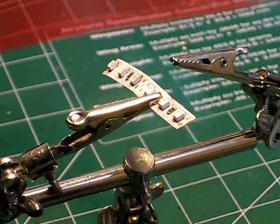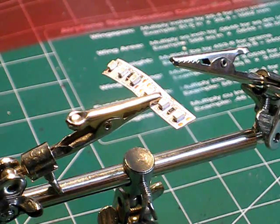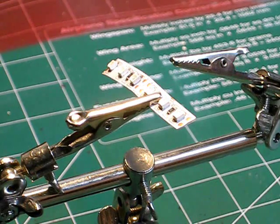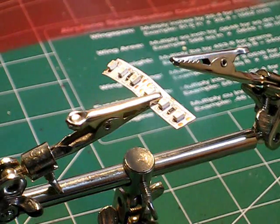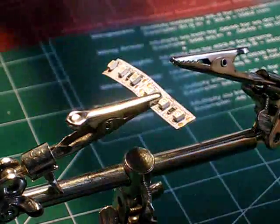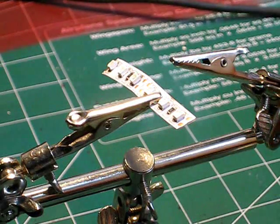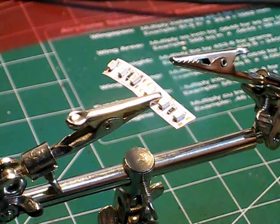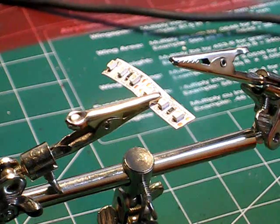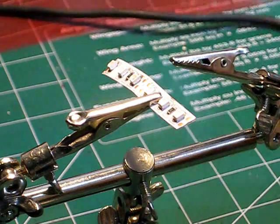I've got the camera set up to get you as good a view as I can. What you see here is a little piece of LED tape set up on my helping hand stand. I've got my solder iron all warmed up and cleaned off the tip using my wet sponge. You always want to start off with a good clean tip — that's one thing that will help you solder a lot better. Contamination really messes with solder. I've got a little piece of magnet wire and I need to switch hands here.